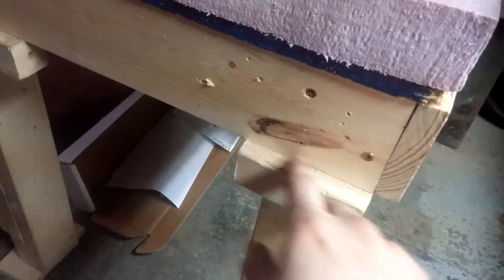Now you've seen the underside, and I'll show you more once I get it open. This is the operation of it. You don't need much room — less room the better. You want to create a radius where your hinge will be on this corner, just outside of it. If you've got a compass to make your radius for your curves, just use it for this. I sanded down the cleat a little bit on this side so if it caught low it would ride up and give a positive stop. On the other side of the gate I put rests — also sanded — so when the gate is closed it's resting on all four corners. The only time it rests on the hinges is when it's open.